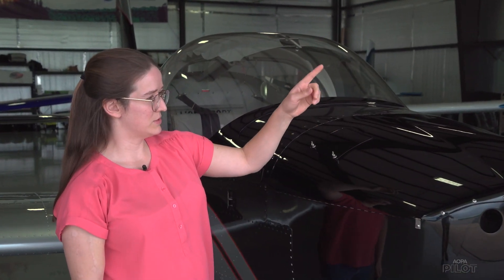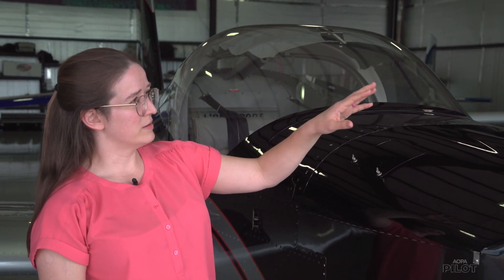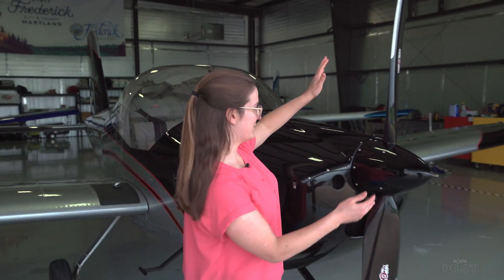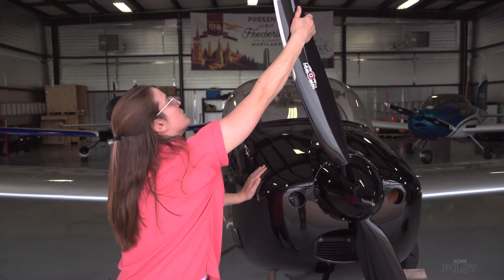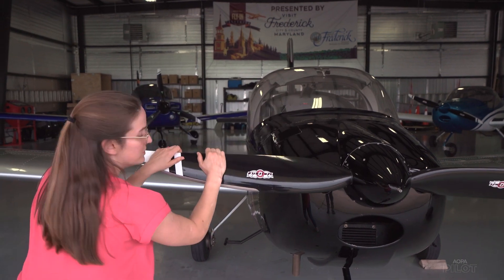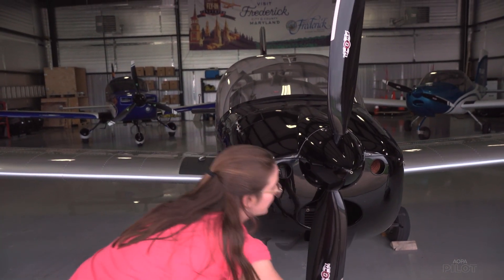So what we're going to do is turn this propeller and try to build up pressure. You can do that by doing a nice slow stroke. You don't gain any points by going fast, and you're going to feel more pressure around top dead center. So go real slow, feel the pressure, and then you feel it go, and you just keep turning.